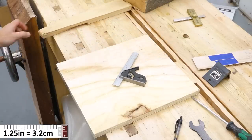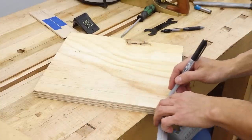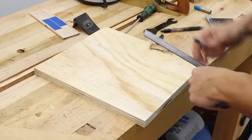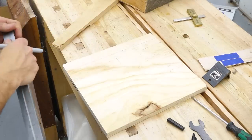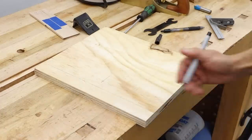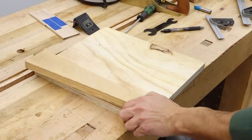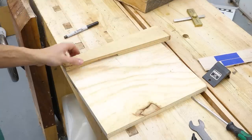This one here is at an inch and a quarter, so that is what I'm going to do for the new jig we're making. Since I already have a one to eight jig, I'm going to do a one to six — why not. So I'm going to come up six inches and mark that out. I know I want it to be an inch away from the line. So if I set my square here to two and a quarter, I'll put my intersection right here. If I connect the starting point down here to here and keep going, that'll be the slope or angle for the jig. You can see how much more drastic and steep that angle is versus the one to eight — it's almost an inch difference by the time you get a foot up.